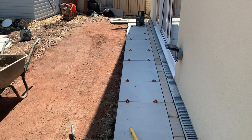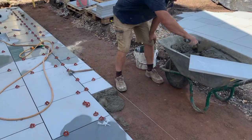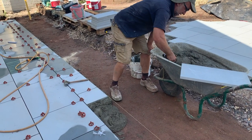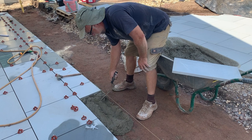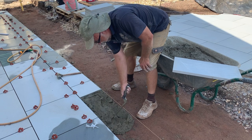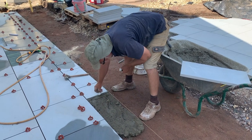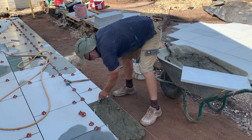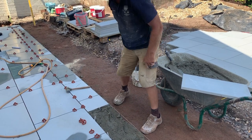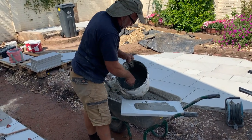Just in case anybody's skipped forward and didn't see the installation, I'll show you what it's like. A couple of trowels of cement — it's slightly wet in this mix, but those little gizmos are actually helping stop any of the tiles from moving. Nice bed of cement going on there. Getting the exact amount right, I'm going to stick some of these clips in — one in there, one in there. They do say it's like self-leveling, but it's not really — it does help lock them together, but the slabs are so heavy it's hard to lift.